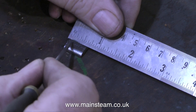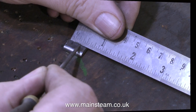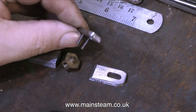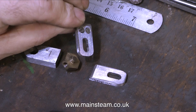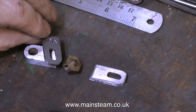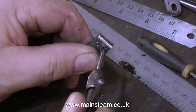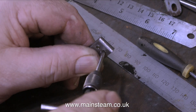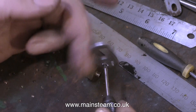I've rounded the edges of the two side pieces. Now I'm measuring and marking out for the holes to be drilled. Once I've drilled these holes, I'll countersink them to take two countersink bolts. These are 6BA bolts that will pass through the thick middle piece, but will be threaded into the other side — so I'm going to drill the other side tapping size and tap it 6BA. And if you're doing this, don't do what I did: I broke the tap off in the hole, but it quickly came out. You've got to be very, very gentle with steel and 6BA taps — they are very small. I always buy good quality taps, but I was just a bit ham-fisted and broke it. Luckily, I got the broken bit out and started again with a new tap.